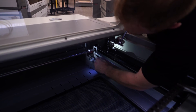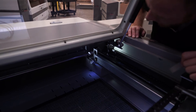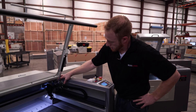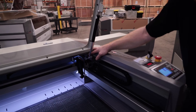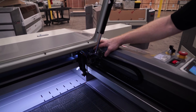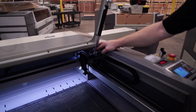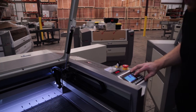Every time that activates, it turns the diagnosis light on on your display pad. For the hood protect, it's protected by a mechanical limit switch that has a prong that pushes down a button when the hood is closed, and that also turns on the light on your diagnostic.